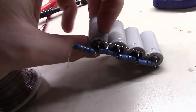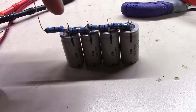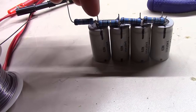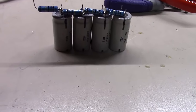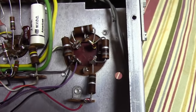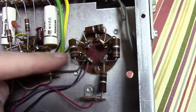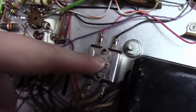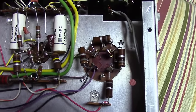As you can see, we've got the positives all tied together commonly, with an 18-ohm 2-watt resistor between each section of the capacitor, and then another 18-ohm 2-watt resistor leading off the final section on the end. Comparing that to the original unit: one, two, three, four sections, all connected with an 18-ohm resistor in between them, and one final resistor on the very end connecting over to the bridge rectifier. We've built basically the exact same circuit using new modern components.